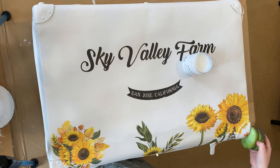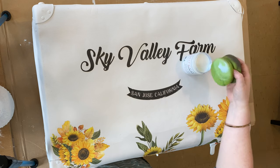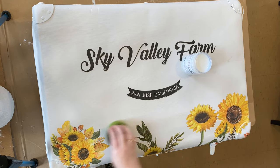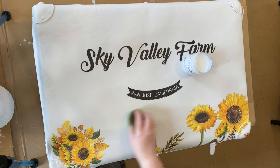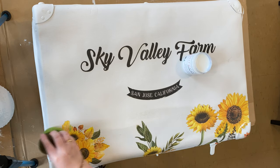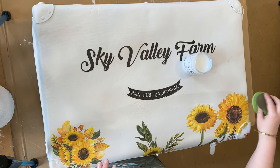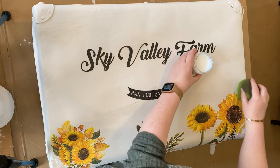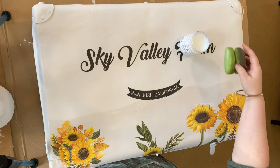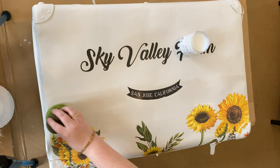You can use a brush or a roller as well, but personally I find I just don't achieve the really nice finish that I can with a sponge. So, nice long strokes. You want to overlap the edges from where your previous stroke was to where your next one is, but you don't want to keep touching previous areas that you've done — otherwise that's when you start having streaks and issues with your top coat. Nice long and even from one edge to the other, with just enough on your sponge.